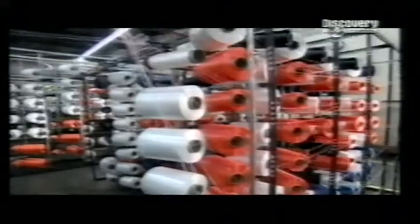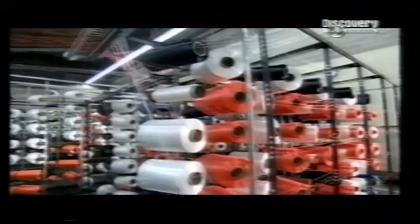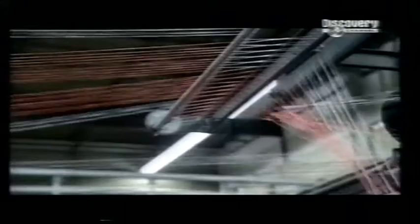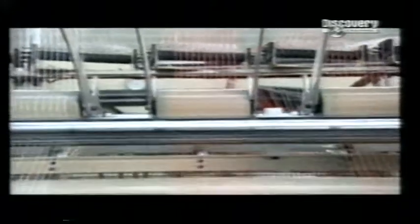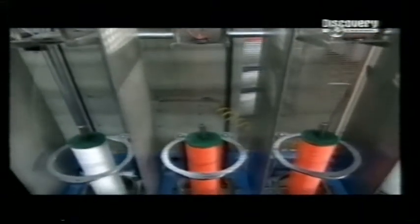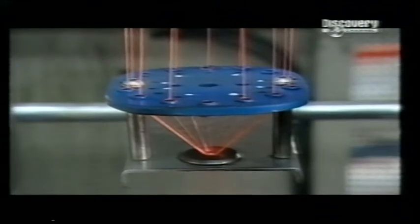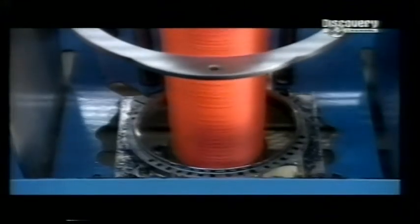This is core yarn and it will be used to make other rope. Now, dozens of spools of nylon fibre unwind at the same time to make jackets to protect the core yarns. The fibres travel several metres over a network of rollers that act as guides and control tension on each individual fibre. They pass through distribution plates as turning bobbins below twist the fibres into yarn.